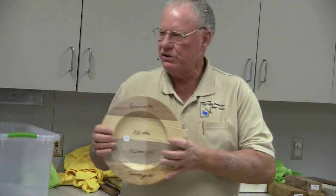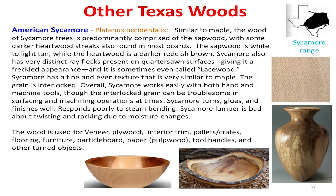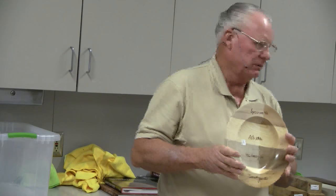Some of the bad characteristics of sycamore: don't bother cutting a piece of lumber out of it. You take a 10-foot board of sycamore that's a foot wide, and you cut it, and you come back a week later — it's going to look like a corkscrew. Next time it rains, it's going to corkscrew the other way. Nobody uses sycamore for lumber, but it makes beautiful bowls. Be prepared for the wood movement, but think about what we do — when we turn a bowl, we seal it, so we've limited the amount of moisture that goes in. It's not going to warp, and it has beautiful characteristics. Sycamore is a great wood you need to try.